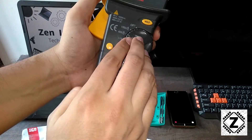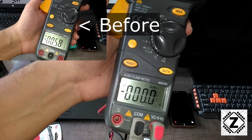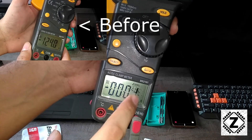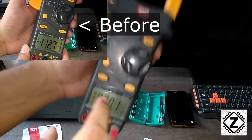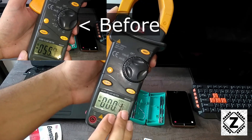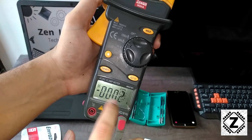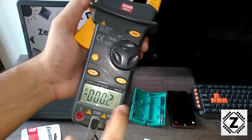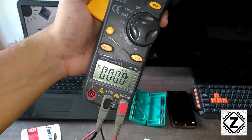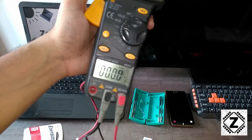The battery is installed — let's see if the problem has been solved. Hit zero and we can see the display has become very stable, staying somewhere around zero. The 0.1–0.2 readings happen because there is some magnetic field in the air — sensitive clamp meters often show this, so it is normal behavior. Hit zero and it stays nicely around zero.